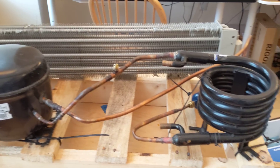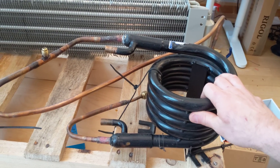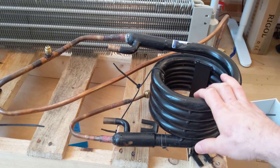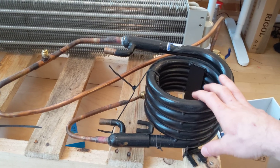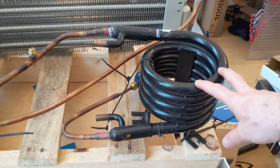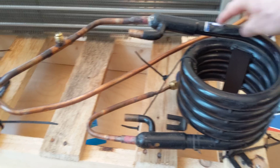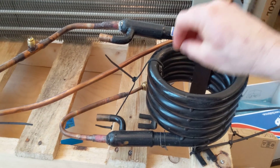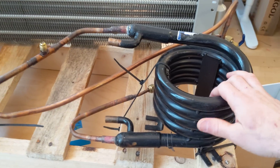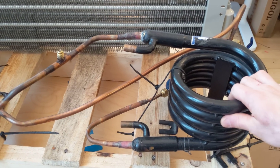Some things that make this interesting are that I'm using a water-to-refrigerant heat exchanger for the condenser. That's because in my apartment there's really no access to fresh air from the outside. The only place you can reject heat to is a water loop that the building gives you. You connect the water loop to the outside of this pipe, and there's a second pipe running inside that carries the refrigerant, so you can condense the refrigerant using the cold water — which is actually not cold, it's like 90 degrees — but hopefully you run your refrigerant so that it condenses at higher than 90 degrees.